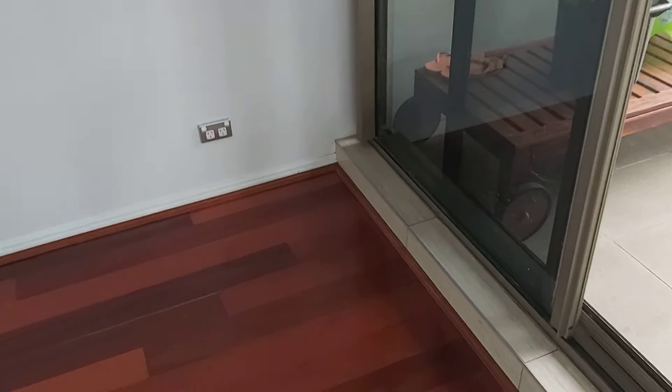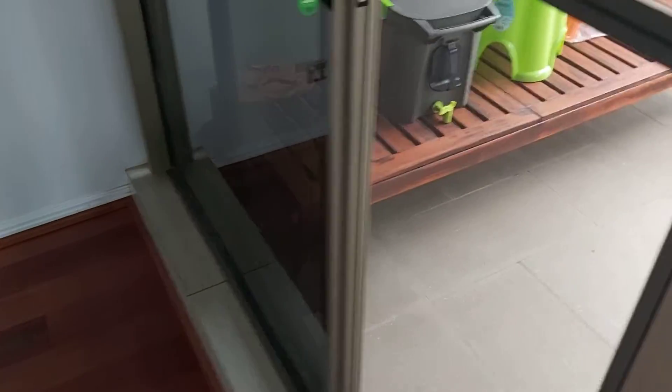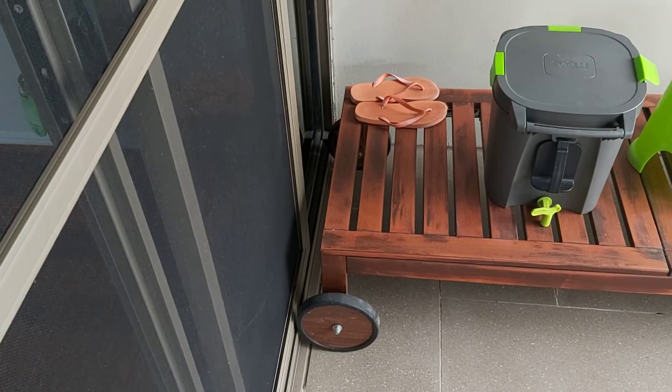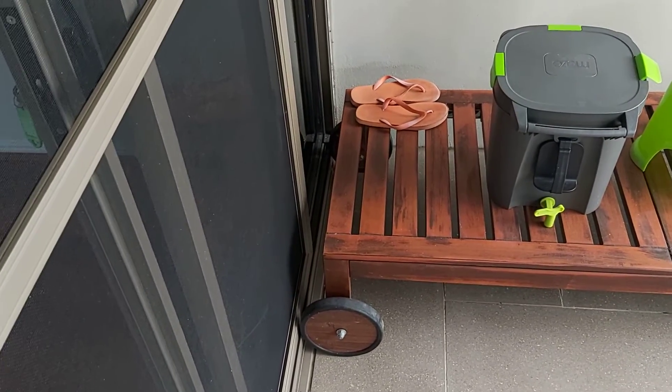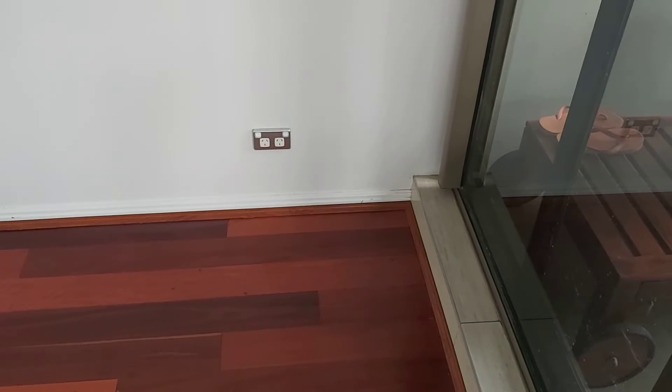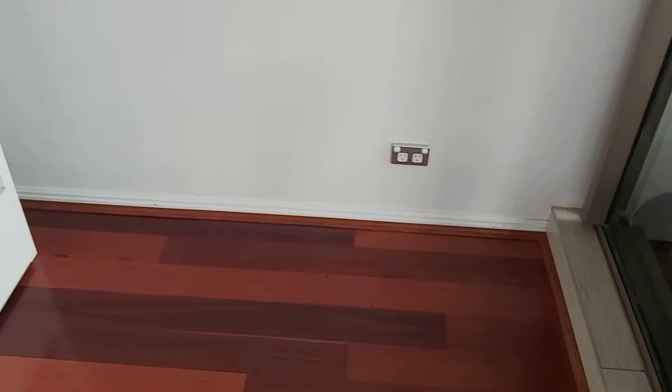Unit 24 Korea Street. Water is leaking through the air conditioning condensate hob penetration — we think in that corner — and terminates in that floor waste. Water is leaking from that hob all the way back along that wall.